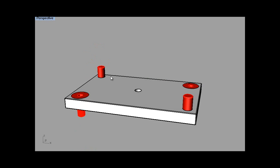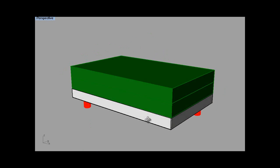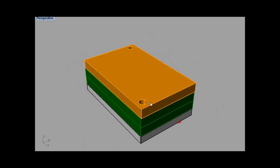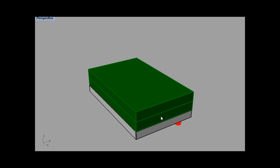I suppose you could use, well, anyway, that's what you need, two pegs. So that's bolted down to the table, and then what we're going to do with that is fit a big block of wax on it, like so. Now obviously because you've got the pegs, it's not going to fit on, so I've also made another piece of steel or plastic or whatever with the two holes that correspond with the two red pegs in. Now you could put this on top of the wax and just drill through with a hand drill, or halfway or full way, whatever. So this will keep the drill square, and it's only wax so you'll be able to drill in, and that'll allow you then to fit this onto that, and those two pegs of sufficient diameter will be enough to hold it for all intents and purposes.